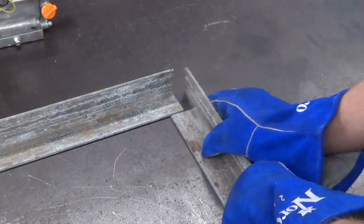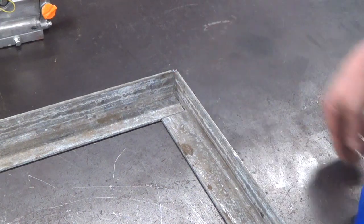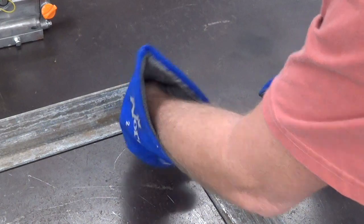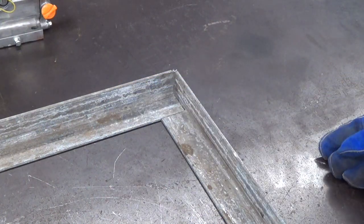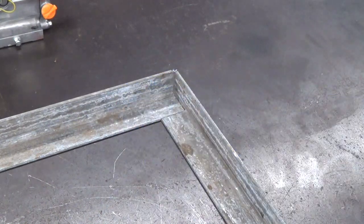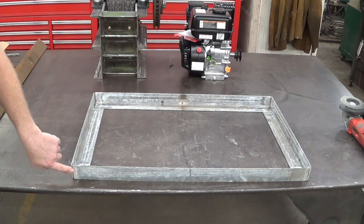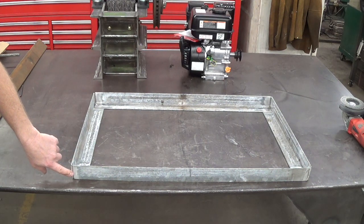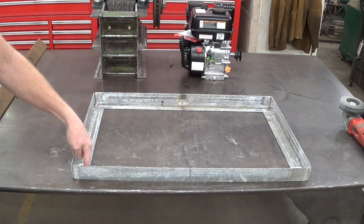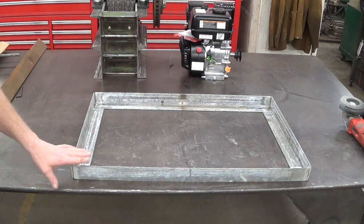This is how that joint goes together — I just coped it out. I'll do a fill weld right here in the outside corner, and here and here I'll weld that also. I'll prep this up with a little flap disc and clean back some of the galvanized. I've got the zinc plating moved back quite a bit. I'm going to put a box tube leg inside here and get those cut before I start welding.